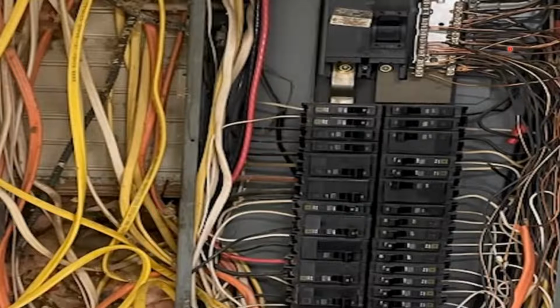So he came up on this job. They're getting ready to clean that mess up, likely install dual function breakers if I know my buddy. And they're going to phase everything, because if you didn't, you'd have to go back through the entire house and change every single receptacle, every single switch, every single joint. So they're going to leave it the way it is, but tape the whites black and tape the blacks white. That's the only way that, you know, he could come up with how to deal with it. But this is just an interesting one that I wanted you guys to see. This is not one that you would see very often.